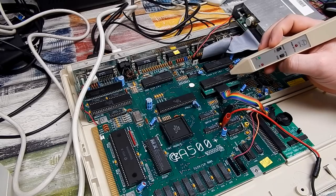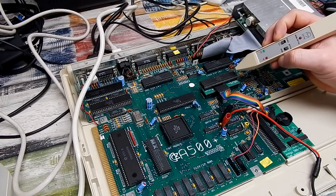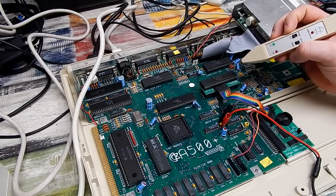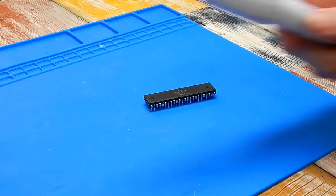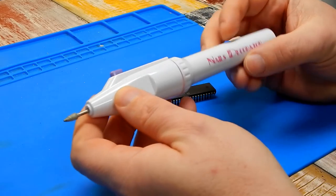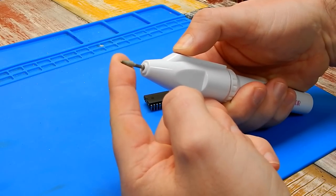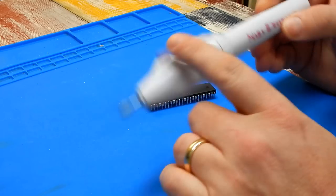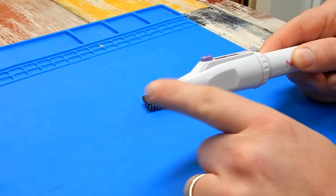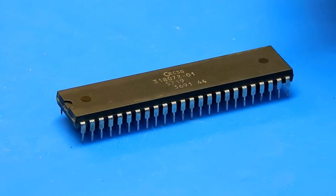What I am going to do is pull the chip out and grind off the surface of it to expose pin 3. I just want to see if there is corrosion internal to this chip - if there's potentially a break, and if it's something we could maybe fix. The best tool I have found for this is an electric nail file. The reason it works so well is that unlike a Dremel, when it's going you can very easily stop it - it's not really possible with this to apply too much force and cause damage, because if you apply too much force this will just stop turning. Despite that, the stone on the top is more than capable of grinding the chip away. Don't worry Gary, you won't feel a thing.